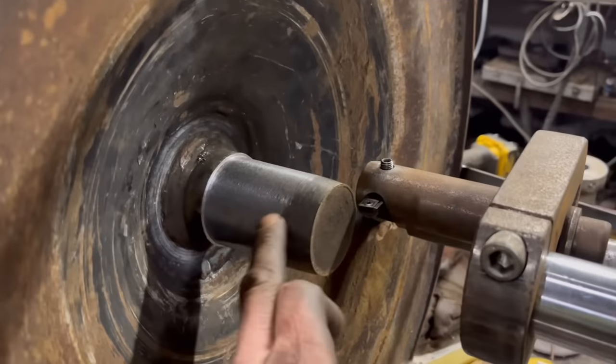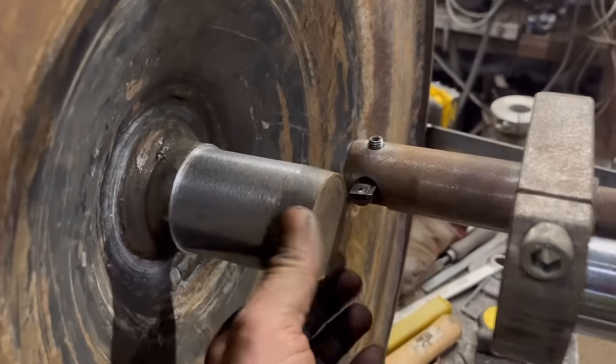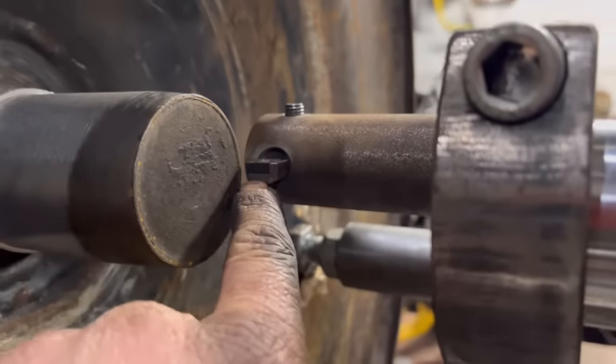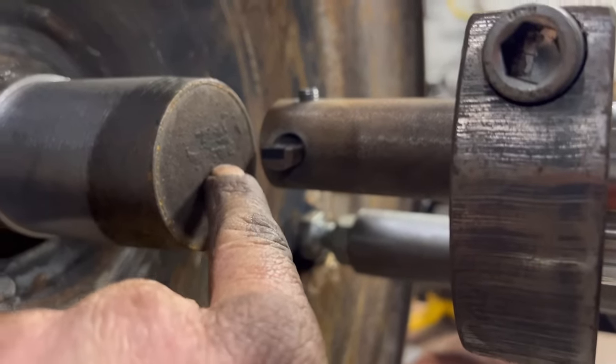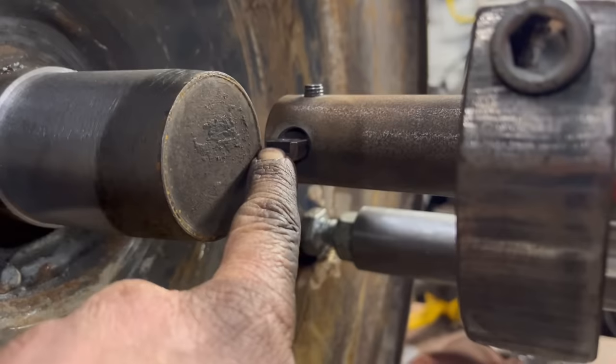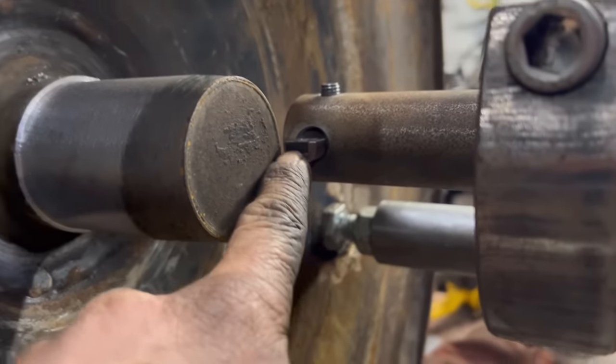So that's set and cut done, that'll do now. I can clean the rest up with a grinder. It's terrible cut quality. I think this tool is too high. When you look at where the centre of the bar is, about there, and the height of the tool, I think that tool height is too high.